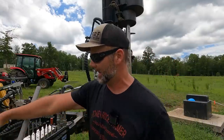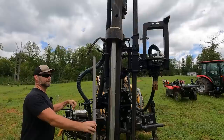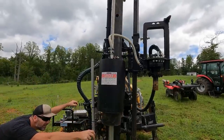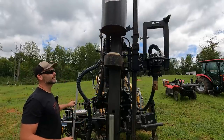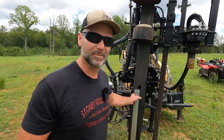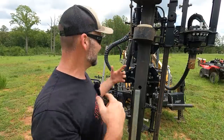With my marking post right here I'm just going to start driving. I'll take my hook, hook my rope back on, lift it off the post, and we are good to go. That's one post down — we've just got to repeat this step four times. It's driven in the ground and that dude is stout. The reason we drove it this low is so that it holds the ground very well in case cows get up against it. Cows will tear stuff up, that's for sure.